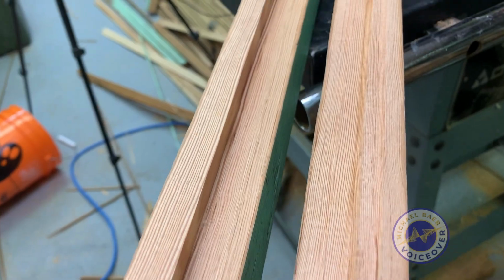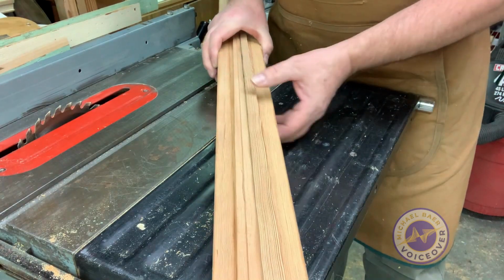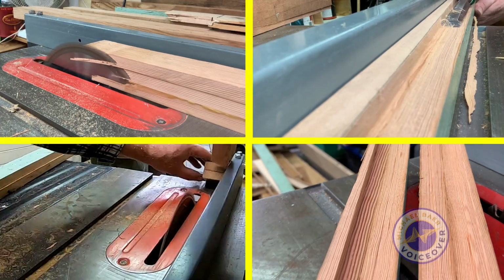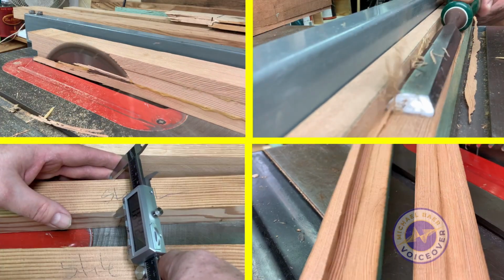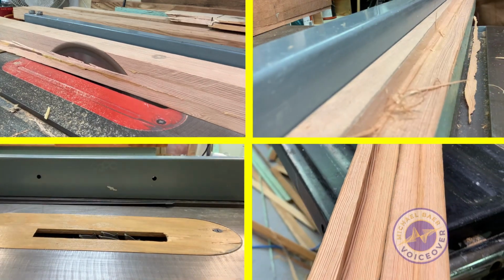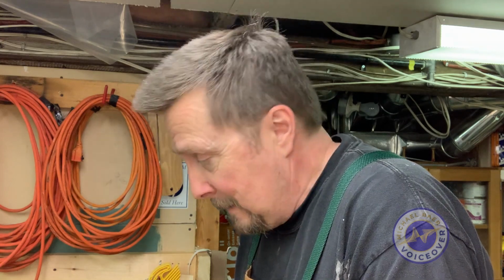When I went to make the pieces together, left and right stiles, of course, they didn't match. Oops. Had I been cutting straight rabbets, it wouldn't have mattered, because I'm just doing a straight vertical rabbet. I had to manufacture two more stiles, throw out the old ones, that I could then cut on the other side of the blade and then cut the taper on that side. So when I put them together in opposition, they will mate properly. Does that explain it? I've confused even myself, which is why I made the mistake in the first place.